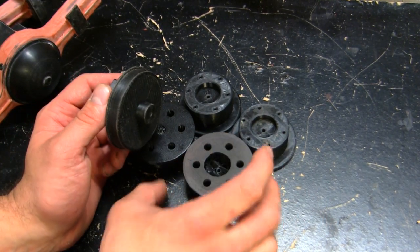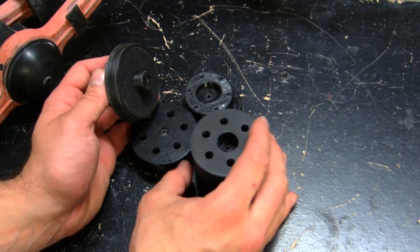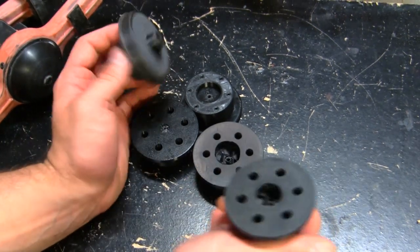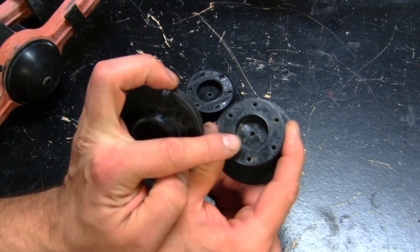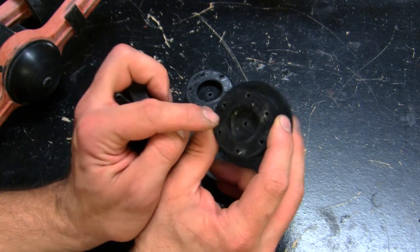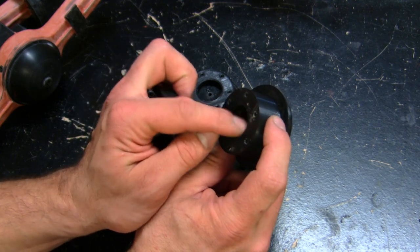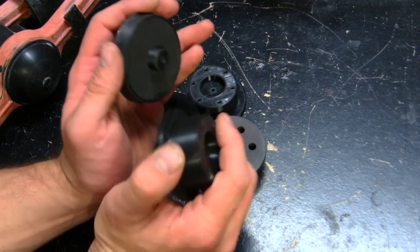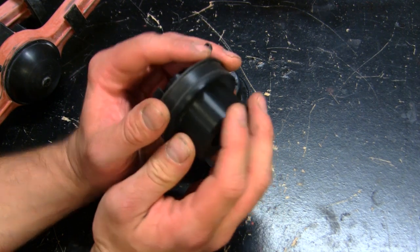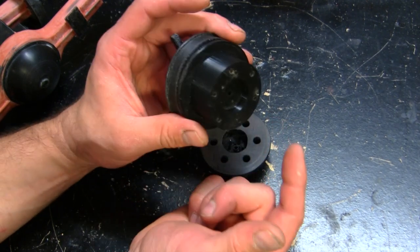In order to secure these to the front, here we have the front section. Now, these ones here were modified from two rear ones. The actual production units will have this already pre-integrally printed on, and it will be the appropriate size and shape. Anyway, so this here, the center hole is an eighth of an inch in diameter, which is the perfect size for an M3 fastener. The eighth of an inch is wide enough for the fastener to slide on in, but it's just slightly wide enough where the threads don't interfere and grab onto the walls of the drum. This section here is actually tapped, so the piece threads directly in place, and once on, it secures the unit to the piece, but in a way where it still allows the unit to fully rotate.